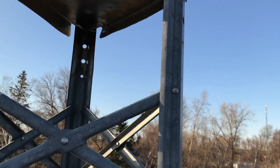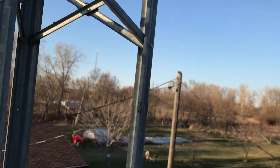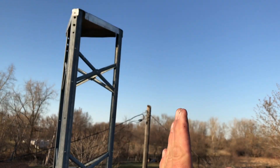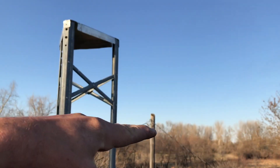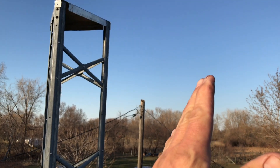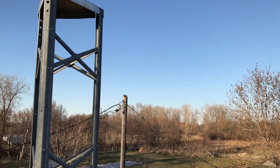Not going to show you how to make a cap — you guys can make a cap. What I'll end up doing is mounting the horizontals straight across here, the vertical here, and the dish basically right there. High up as possible — I want the dish to be just above the top. It also has to be far enough out from the tower that the dish, when it turns or adjusts, doesn't contact the tower. So I'll have to make that calculation and see how much distance I need on those horizontals.